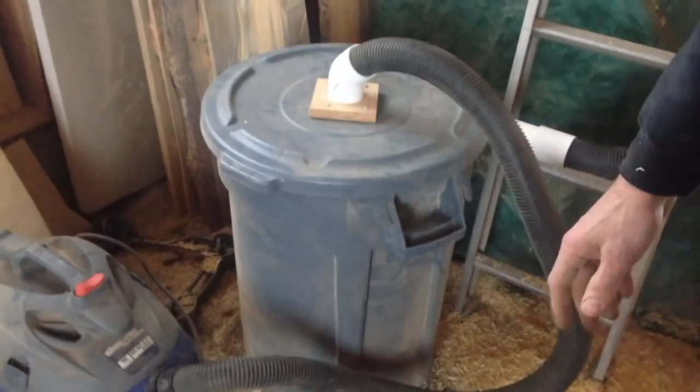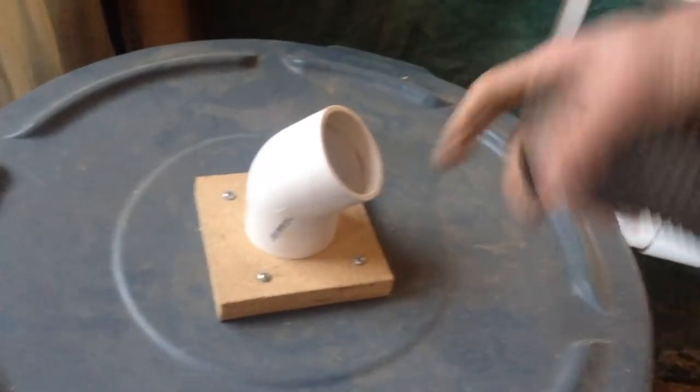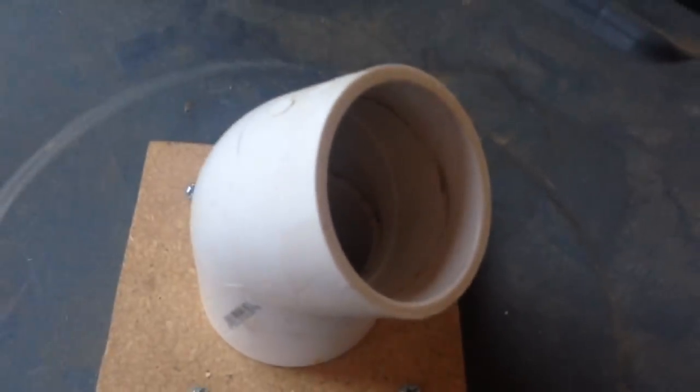And then I bought a new trash can. You don't have to buy a new one — you could use any style of trash can you have, just as long as you make it seal up well. And then other than that, it's just some PVC parts. This 2½-inch hose has a nice friction fit on the inside of 2-inch PVC fittings, because that's made to fit the outside of 2-inch PVC pipe, which is 2½ inches, roughly.